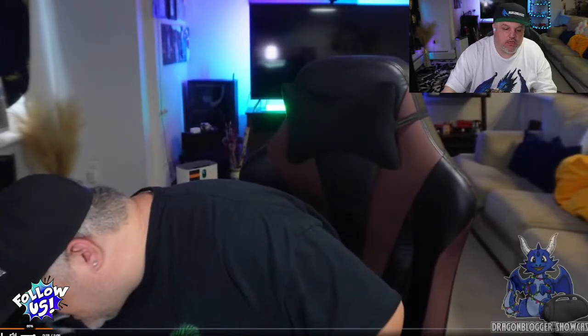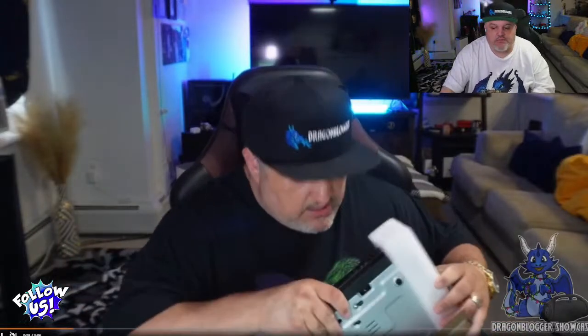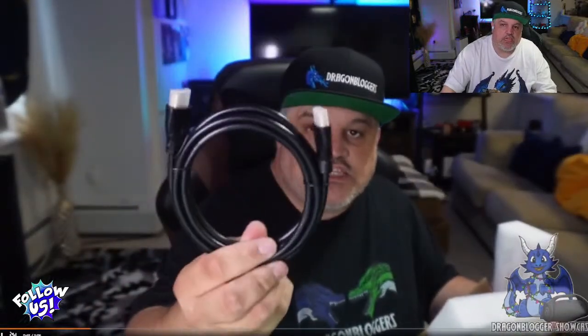Now, you also get, of course, the... That's right, guys. Power over Ethernet. You get 4 cameras, the NVR system, which is going to be like your hard drive, built-in computer system, right? And that's where you're going to access all of the videos with this. Now, since it is an RJ45 style connection, which is your power over Ethernet, you can connect up multiples of these and not have to worry about it.